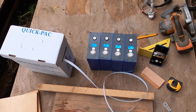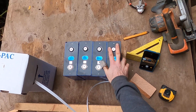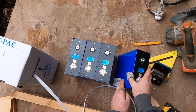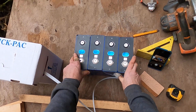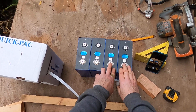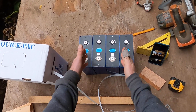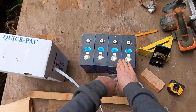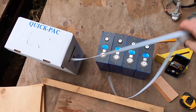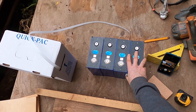I've read that they need to be bundled and compressed because what ends up happening is they bloat — the sides will expand a bit as they are used. And what that can lead to is if you have some expansion and contraction there with bus bars on here, it can rip out the terminals or cause internal damage. You put a lot of stress on your bus bars and you don't want that. So we're going to bundle and compress them to keep them immobile as we use them down over the years.